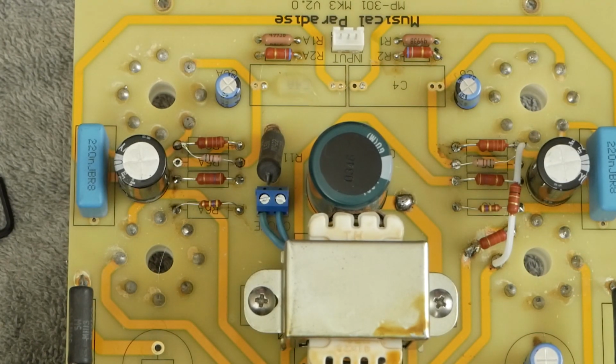The 300B I built ended up using a cascode, which is the sister to a pentode, to drive the 300B tube, and it sounded much better than trying to use a pair of triodes stringed together to drive it.